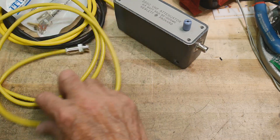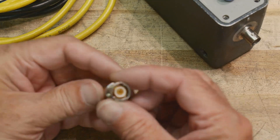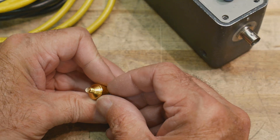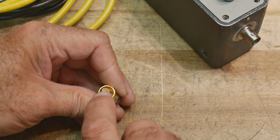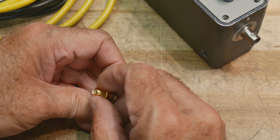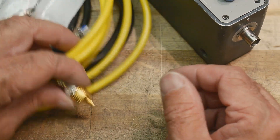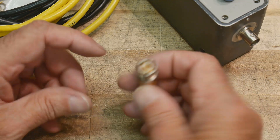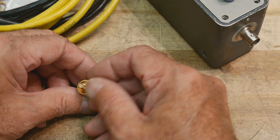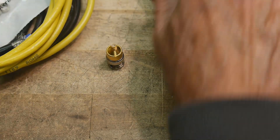There's also this weird little connector that was supplied with my Keithley. I've never seen one before — it's triax on the input with the three-prong style, but on the other side it's also triax, except it looks like SMA triax. It's threaded on the outside, with a double shield — a shield on the outside and a shield on the inside. These must be super expensive. I can't imagine having to build a cable for it — it's super tiny.